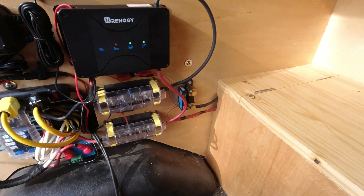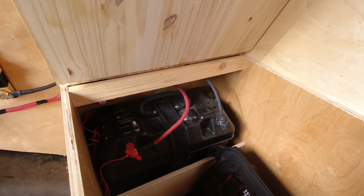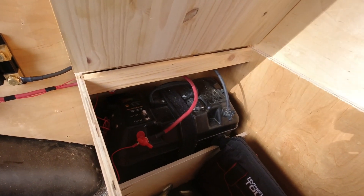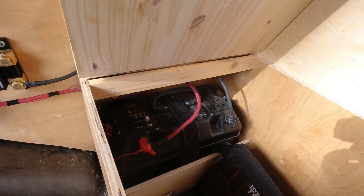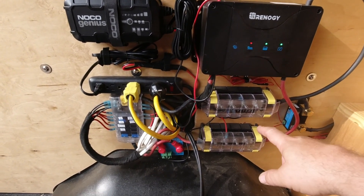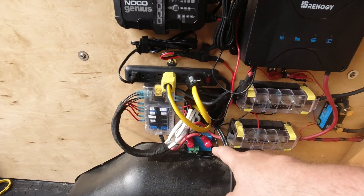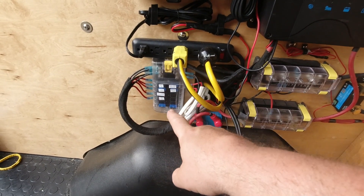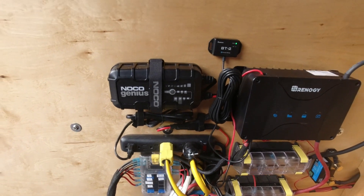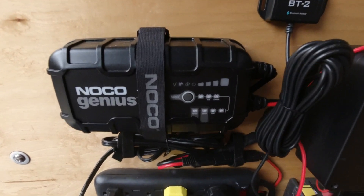We've got sort of a temporary solar setup because we haven't mounted the panels yet. It charges a battery which is under this bench - you can see the battery over here. This battery is one I already had; it's in a trolling motor box, used as a portable solar generator backup for my CPAP machine. We've got a Battleborn on order and when that comes in we'll swap it out. Power is distributed through these bus bars, and from the bus bars it goes to the loads via something called a Battery Protect, also from Victron, and we've got a Blue Sea Systems 12-volt distribution and fuse box.